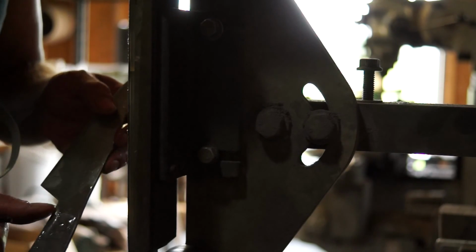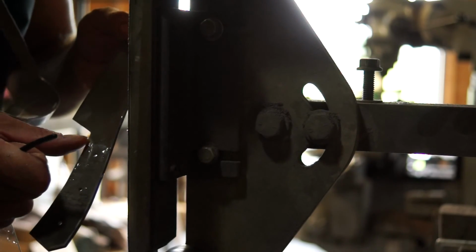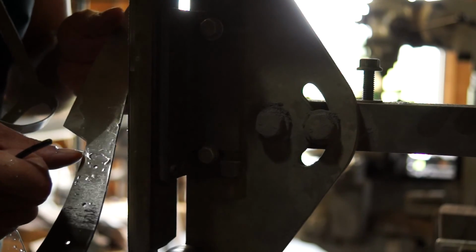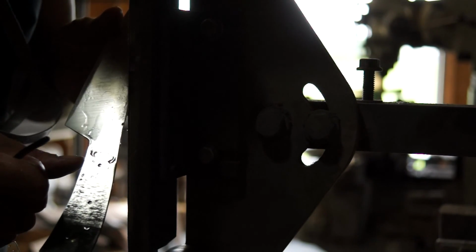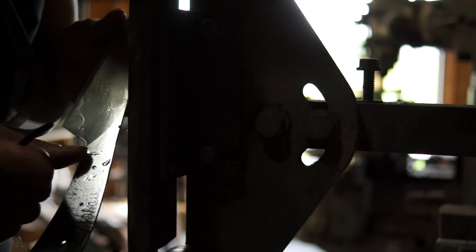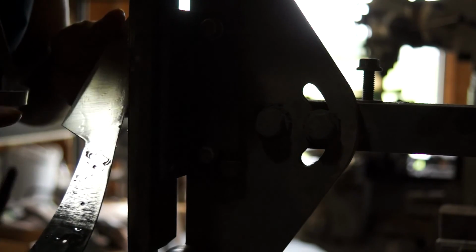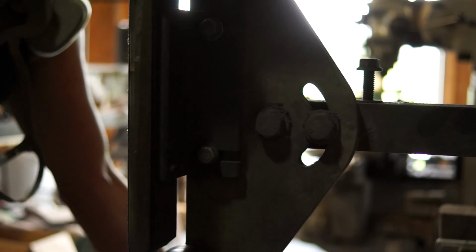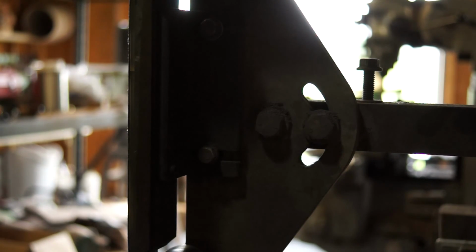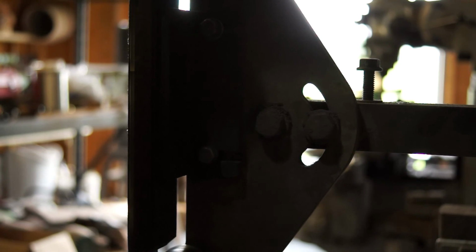The big thing is, you want to make sure that you don't run that plunge too far back onto the flat area, or you have some issues with scales fitting and leaving gaps. So I guess that's the down low, dirty, blended in plunge. There's really not a whole lot to it, but like a lot of people will tell you, do it a couple hundred times and it's easy.